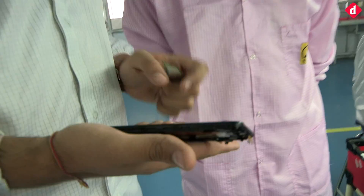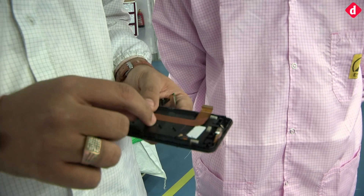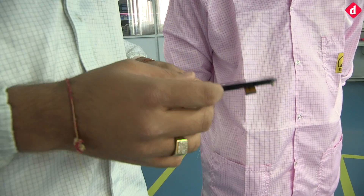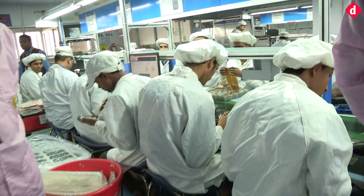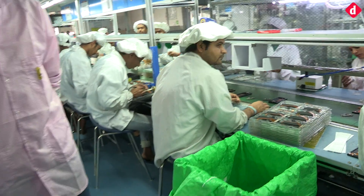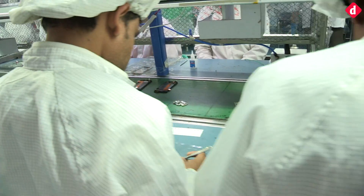Along with this, the touch panel and LCD also come in assembled form from China. The first step is that the operator checks all the functions — whether it is working or not, whether the touch panel and the LCD liquid display are working. After checking the complete assembled part, it is fitted on the line. Components like the vibrator and camera are soldered here. ESD electrostatic components and electrostatic mylers are also pasted in this PCB as well as in the touch panel. Various functions are already communicated to all the operators for each manufacturing step.